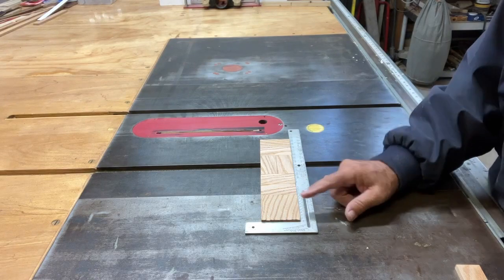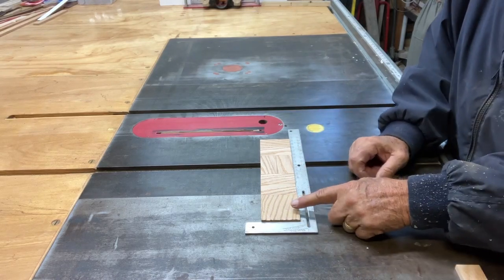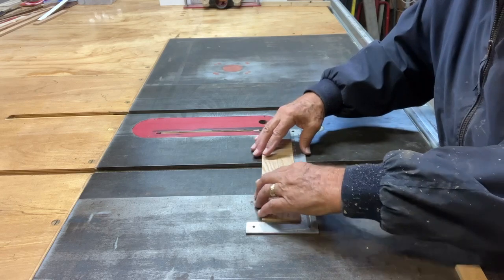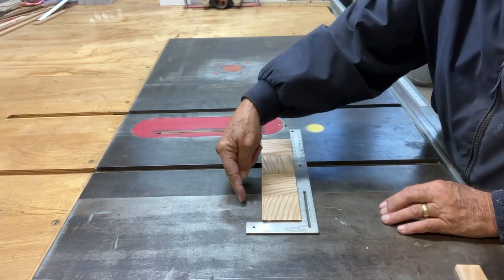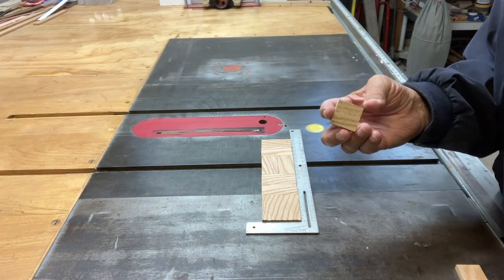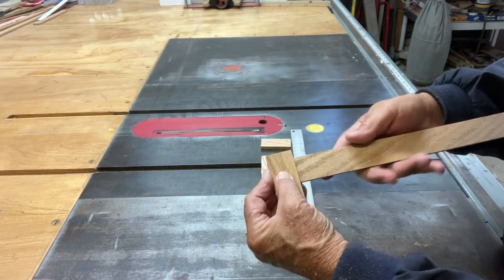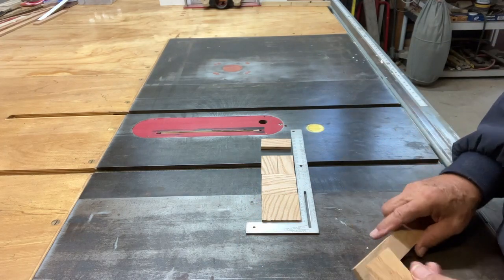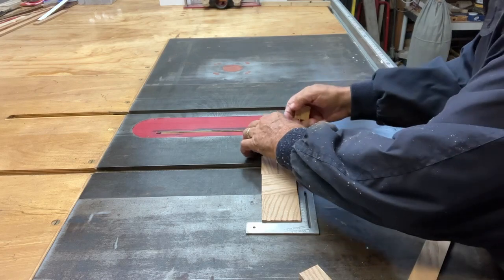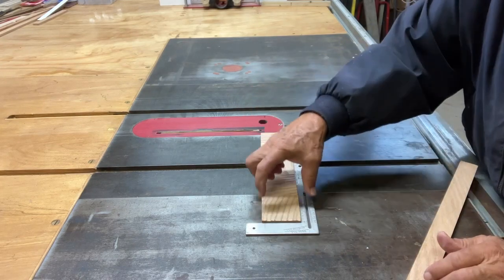After cutting those six pieces and my square, I put them on a flat surface with a straight edge and a square. I put my two and a half inch piece, two pieces going this way, two going another way, two going another way, and verify I have a nice straight edge and everything is cut perfect. To cut the small one and a quarter by one and a quarter piece, I'll take my stick, lay one of these pieces up there, mark it, go to the bandsaw, cut it — need two of them. When you get both pieces cut, add them to the puzzle arrangement and the grain should give a nice straight line.